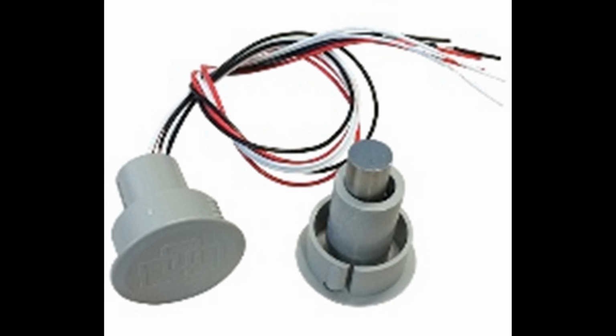Well, I don't know, but I can tell you that you've got 2 commons, 2 normally open, and 2 normally closed. So whatever the description of operation calls for is which of those wires you would select. Obviously, you're going to label them after you check them for continuity, so you know what you're dealing with. But what you're wiring for, I don't know.